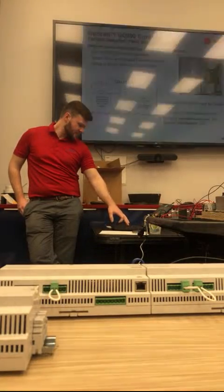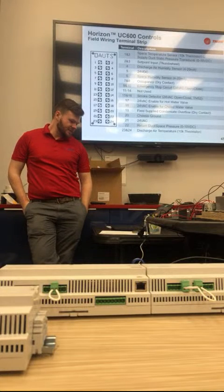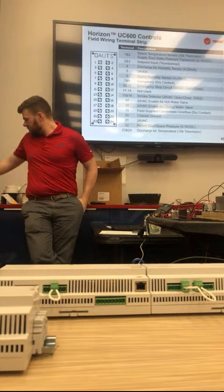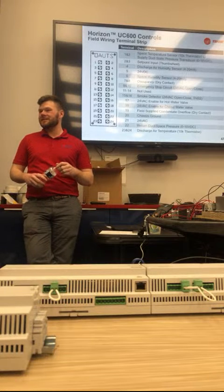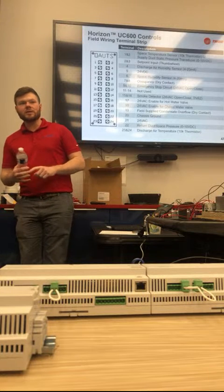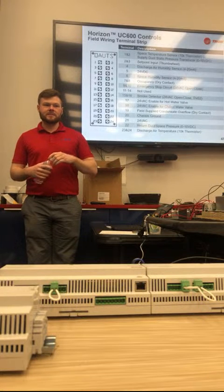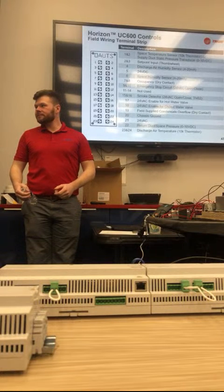And if you ever start up an RRU, we have RRUTS, which is Restaurant Rooftop Unit Terminal Strip. By the way, I do want to make mention, Horizon is not an RRU. They're different. This is Horizon startup only. We also modify Voyager and Precedent, but this is not for RRU setup whatsoever. They're kind of similar, but the program is all different, and they don't even apply to each other.